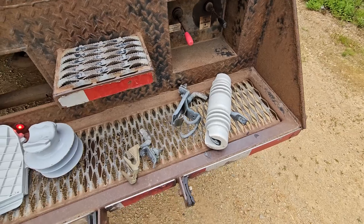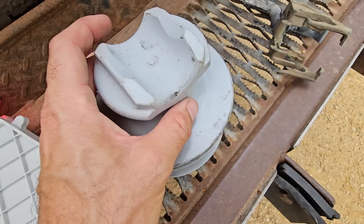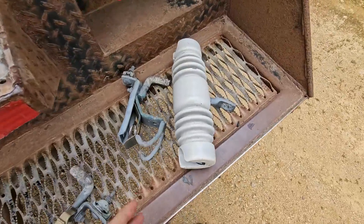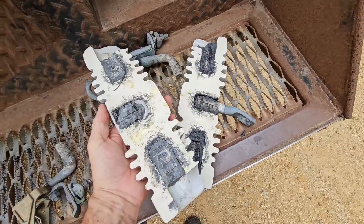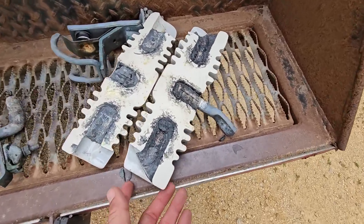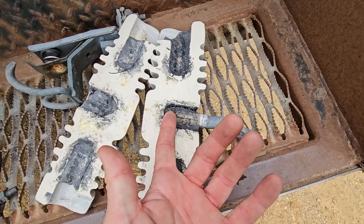When this type of insulator with rubber or plastic breaks down — this one is just a manufacturer defect — you can see the ripples in it. The plastic almost looks like it dries up and starts cracking; that's when you know it's breaking down. Everything has a lifespan — these are probably good for around 35 years or so. The porcelain ones are a little more dangerous because there could be hairline cracks that you can't see. You put your stick on the door, you yank it open, and it could completely fall apart on you, just like this one did. They generally don't break perfectly like this — usually they shear off or crumble into a dozen pieces. You can see there's really not a whole lot of insulation — this is live 7200 volts and there's just that small gap isolating it from the bracket.